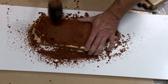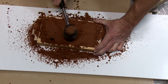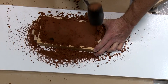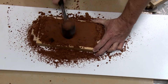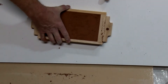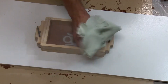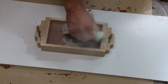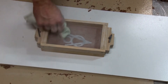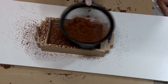The flask I'm using to pack is one I made myself. I try to make them close to the size of the parts I plan on casting — it reduces a lot of time. There's no point in packing a ton of sand if you're making a smaller part that doesn't require such a large flask. Flipping the board over and holding the pattern in works really well. If you don't do that and your pattern falls out, good luck putting it back in without damaging your mold. I'm using baby powder for parting — I don't want to dust myself with talcum powder. It works fine for parting, just not for the finish on the part. This is just reused sand for the back of the part.